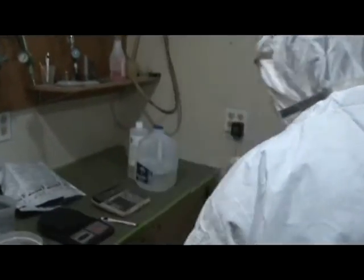Okay, to clean up the spray gun, we'll just go over to the sink. We'll go ahead and take care of the mixing container first. We'll use just lukewarm water, works really good. And it just rinses right out. If you let it set up, you can't clean it with water. Once this paint starts to set up, there's really not a whole lot you can do with it to clean it up.